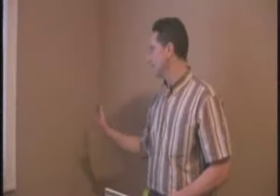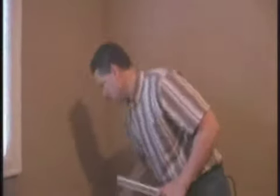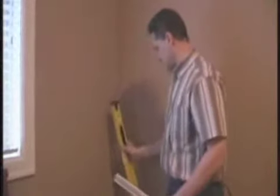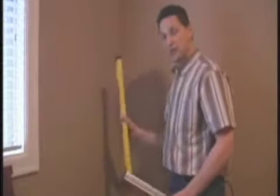With this installation, we have what's called a corner shelf unit. And with a corner shelf unit, you actually have a 6-inch deep gable that goes in the very corner. And so I'm going to show you how we would set that up for installation. Now since this area before the window casing is less than 4 feet, I need to have my 2-foot level instead of my 4-foot level.